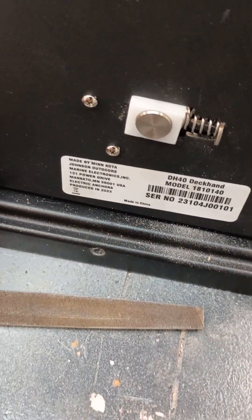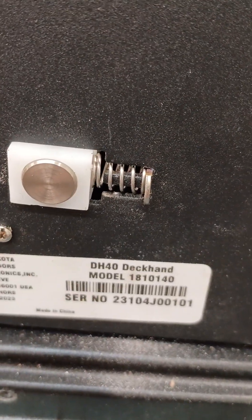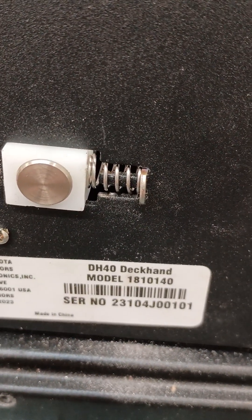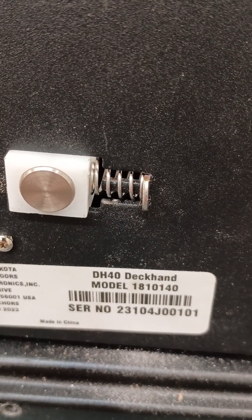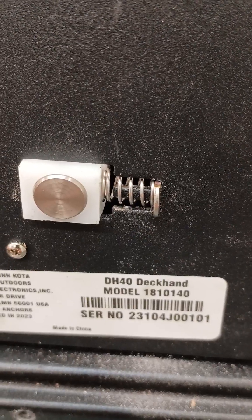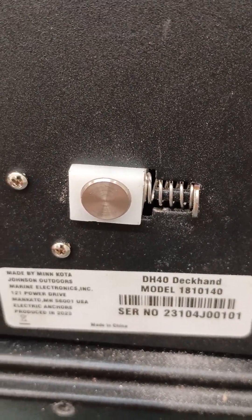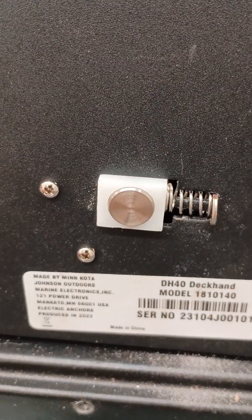File lightly until you've removed about the thickness of one wire coil. I went too far, but that wasn't a big deal — I just took a washer and shimmed it back up. With the washer out and one loop of wire filed down, it dropped too far and took less than a pound to activate. So be very careful — file, then test it.